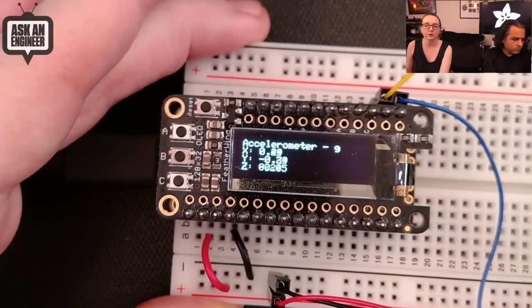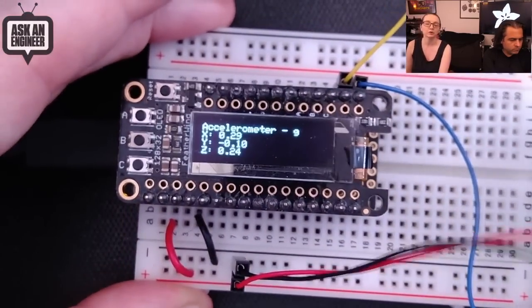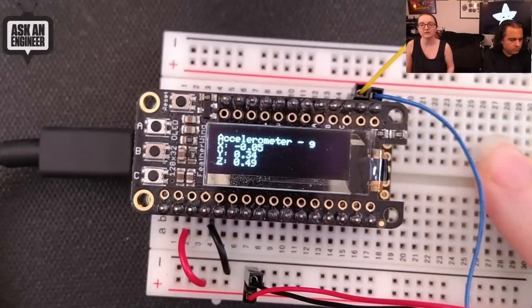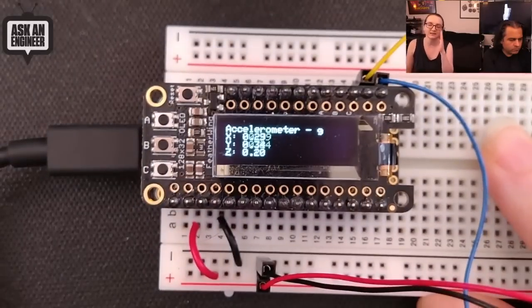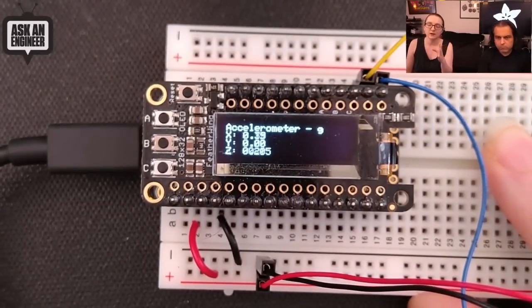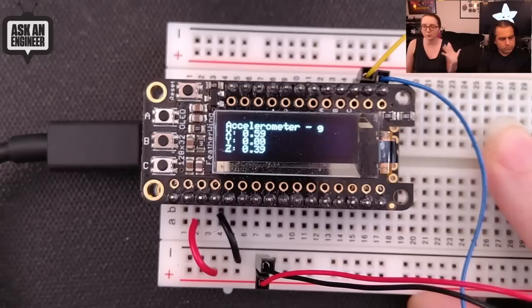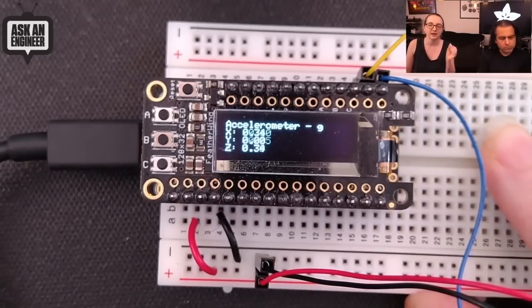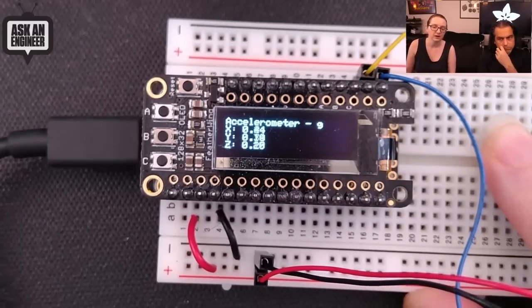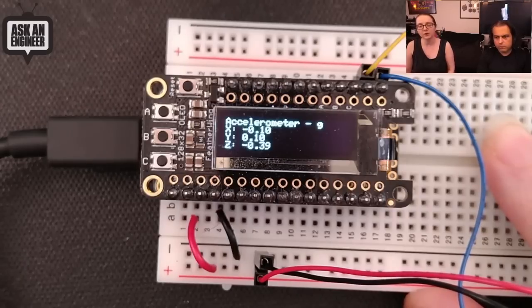But because this is 200 Gs or 100 Gs, you're going to see fluctuations of about 1 G from the sensor noise. The sensor is not designed for measuring small differences — it's meant for measuring very large differences in G-forces. So just be aware of that when you plug it in. You'll want to use the low-pass filter capability or do your own filtering and offset calculations.